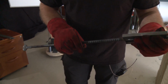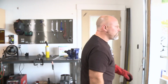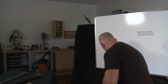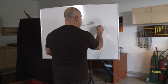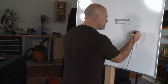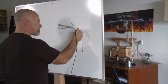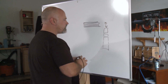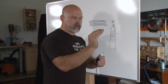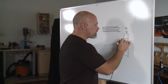It won't be traditional. So the trick with these and with any multi-bar, let me go check this on my billet real quick. That's fine. It's parallel surfaces. Owen touched on this in his demonstration. If you've got a stack of different bars, looking at the end here, you're never going to weld up if you've got this stuff going on, right? Because as you compress down, what's going to happen to that? Well, that's going to go like this, and the whole thing's going to go like this, and then you're screwed. There's almost nothing you can do at that point because you're also deforming the steel. So what you want is a very parallel cold fit.